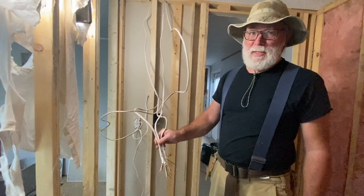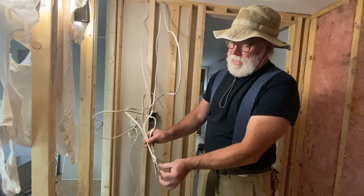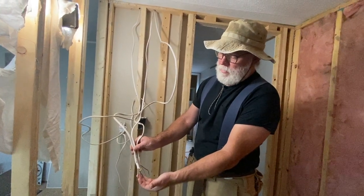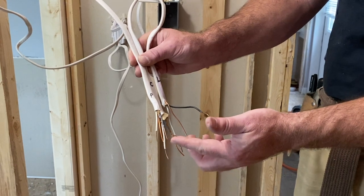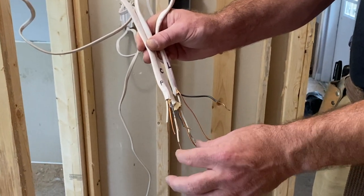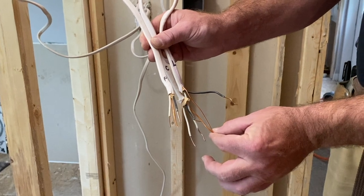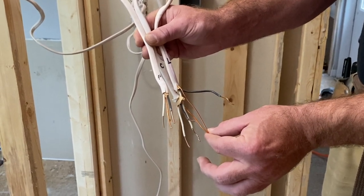This part is going to get a little bit confusing, but see if you can follow me — it's just like running water. The power is coming in on this wire on the black conductor. We want that power to flow to the rest of the circuit, so we'll have to connect these two black wires in order to get power out to the bathroom and the other bedroom. We also need power to go out to the light fixture, but that goes on the other side of the switch to allow us to turn the light on and off. All of these white wires are just returns — that's your common — these all go back to the breaker box, so we'll just put a wire nut on all three of those. Same is true of the grounds — we'll just connect all of the grounds back together to give us a solid circuit to ground. The first thing to separate out is going to be the commons; make sure these all get connected together.